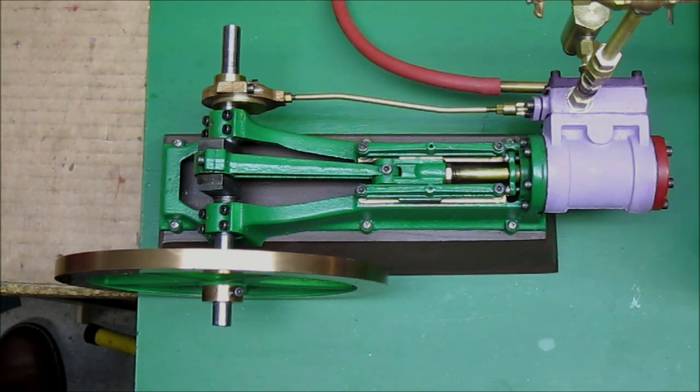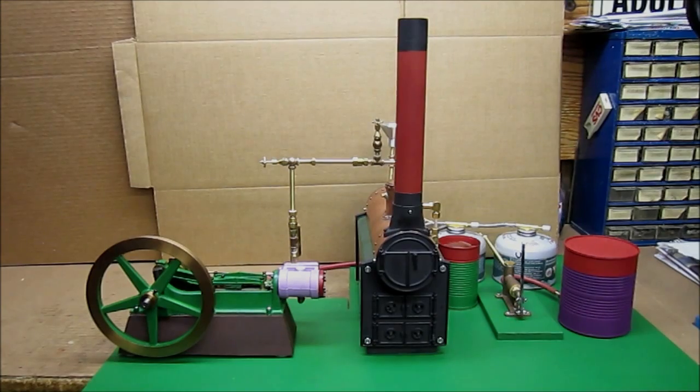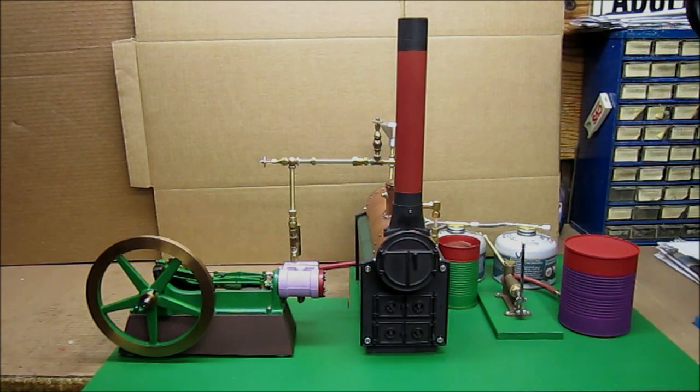It's called steam cylinder oil. In the center here we see the PMR horizontal boiler part set BLR-2. It's a five-tube horizontal boiler, and following that will be a photo of the unmachined parts and supplies provided in the part set. Mine was a little different — I bought mine ten years ago and those U-shaped channels came to me as flat metal, so I had to build a metal brake and learn how to bend sheet metal. Fortunately in the new sets those are already formed and bent. That's the PMResearch horizontal boiler part set BLR-2.